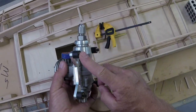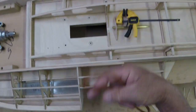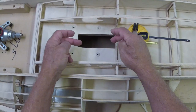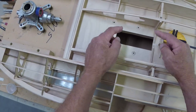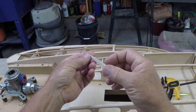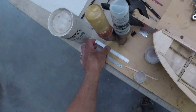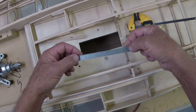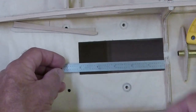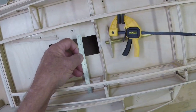This will ride right about here and we'll be able to get the belt on and off. We're going to talk about how to finish this up, because I've noticed a lot of guys hesitate terribly — they kind of panic when I talk about building engine wells, thinking 'Bob cut a big hole in my boat, what do I do?' I will show you. We're simply going to glue in a few pieces. I've already made these pieces here. I made a piece that would fit through this opening. By the way, if you're following along on this build, I previously told you four and a half inches — we are upgrading this to a five-inch-long engine well.